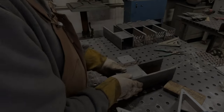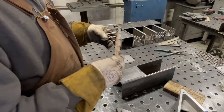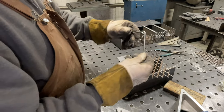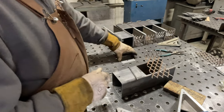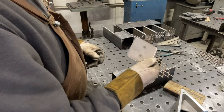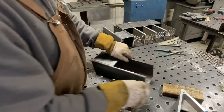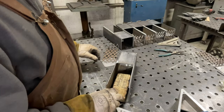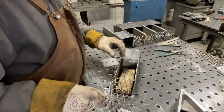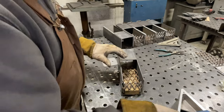Let's put the intake chamber together first. Make sure that you have your coal grate — that's going to slide right into the back here. Make sure that you have your damper rod; that's going to go into the pre-drilled hole. And make sure you have your damper door itself. The easiest way to do this is to grab a one-inch block and set it on the bottom, then slide your coal grate right inside. This will give you the spacing that you'll need on the bottom.